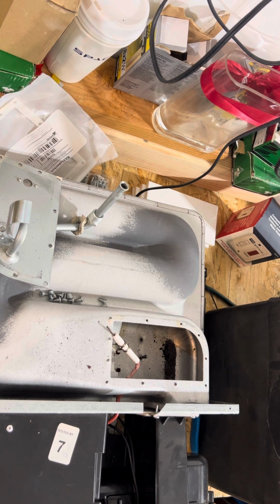I hope this video helps people better understand a little bit about what an RV technician does when he replaces the burner on a furnace. And remember, always use your best judgment when you're doing this. You want to make sure you have the propane turned off. You want to make sure you have the electricity unhooked. You don't want to shock yourself. Some furnaces are 120 volts on RVs back in the day, and still today. Some residential units are 120 volts, and you can get hurt really bad working on them. So you always want to take caution when working on them.